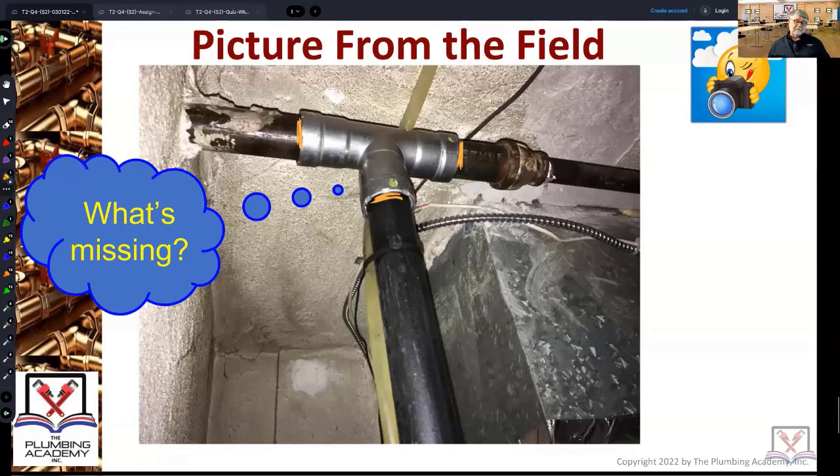There's a lot of shiny glazing going on from the coating over the steel. You should be cleaning the ends up because that glazing chips off and sometimes it will cut the O-rings that are in there. Yes, there are specialty O-rings — they're more robust than what you'd put in a faucet — but it's still a rubber neoprene material that can get cut. So do what you're supposed to do.